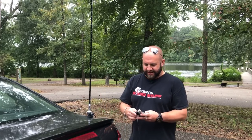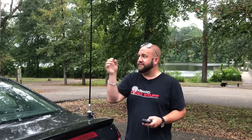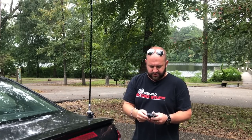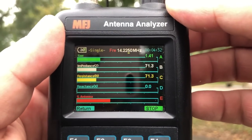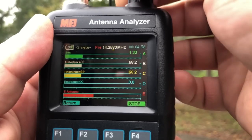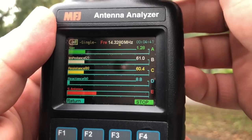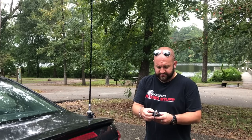Just like that, we've been magically whisked away to Huntsville State Park. We're going to try out this antenna and see how far out we can get. I did shorten the whip a little more by sliding it inside the fiberglass mast. At 14.225 MHz I'm looking at about 1.3:1, and all the way at the top of the band at 14.350 MHz I'm looking at about 1.28 to 1.54. So absolutely perfect — can't really ask for much more than that.